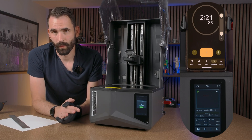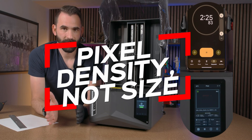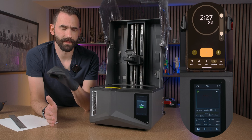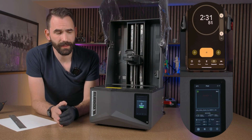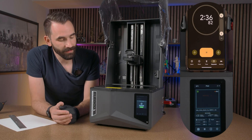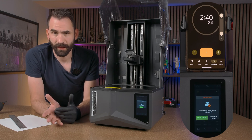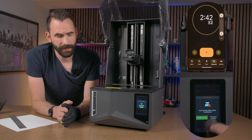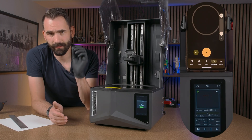This bug has been around since the Saturn 1, but it doesn't really show up in the wild until the LCD pixel size goes up, because that's where the CPU has a hard time processing all the data. This isn't really an Elegoo thing — it's more of the Chitu box motherboard and how it interacts with the display. I've tested it on pretty much every version of the Saturn including other Chitu box-based printers and it shows up in all of them, but for some reason it shows up in Elegoo a little bit more than the others.